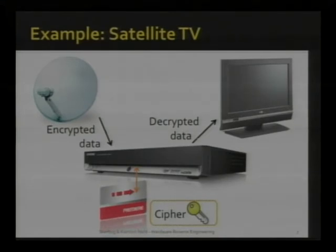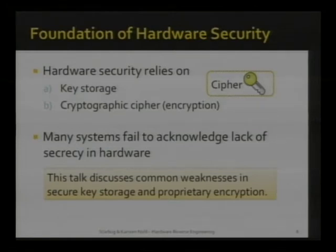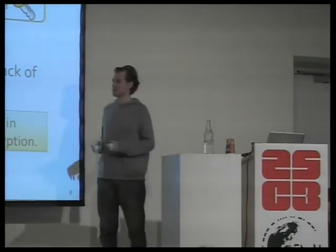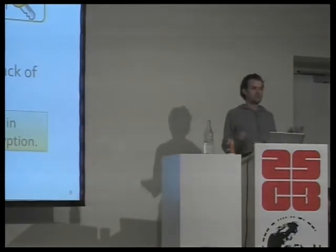So all these applications and all the hardware security applications rely on either a cryptographic cipher or a cryptographic key to be secret. So there must be something that only your customers know, that only your employees know, or their respective cards know. And in hardware security, the mistake is often made that both of these are kept secret and that the security is spread across the two. In cryptography, we very much rely on the cryptographic key being secret, where the cryptographic cipher should be some published standard, and it ought not to be secret because people like us reverse it from hardware. So that's what we're going to talk about today, breaking cryptographic ciphers by simply finding them. And since any cipher that isn't standardized is usually weak, we then normally break it within a few days.